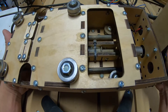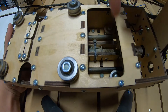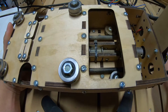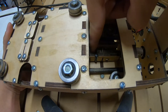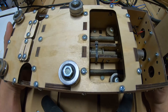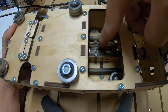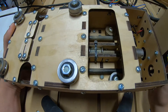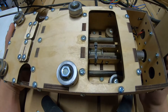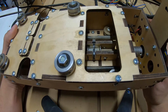Okay, there is the movement that I'm talking about. The problem is there's just a slight — I mean we're talking maybe 1 to 2 thousandths of movement between these two washers. I'm not 100% sure how I'm going to fix that. My ideal repair would be to actually weld a longer nut onto these washers, but we'll see if that happens — I'd have to go to a buddy's shop since we don't have a welder here.